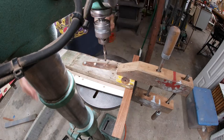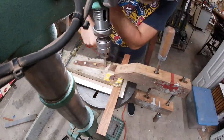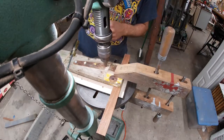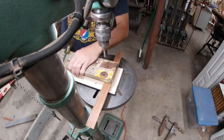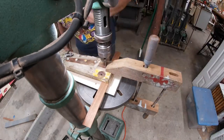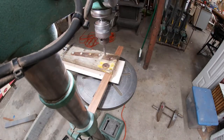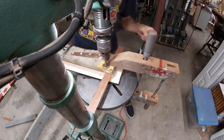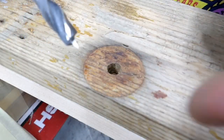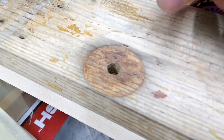Some people suggested that I use the fittings as the template to drill the holes through the spars, but I just don't want to drill down through those fittings. Every time a drill touches them the hole will enlarge, and those parts are not sacrificial — whereas the spars unfortunately are sacrificial.